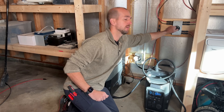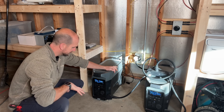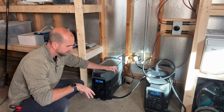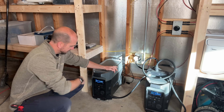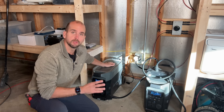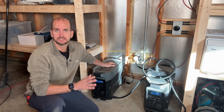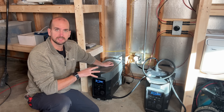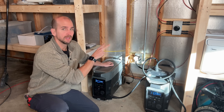Let's flip the isolator switch on and see what's coming into the Delta Pros. This one's down to five percent so I actually do need solar to start charging it - remember, this is the only power source for this garage. It looks great - the sun's just coming up so some panels still have shade. The string of three panels with less shade is running about 330 watts, and the other is running 240 watts input power. In winter, these panels will probably max out around 600 to 700 watts, which is a good amount of solar power coming into each unit every day.